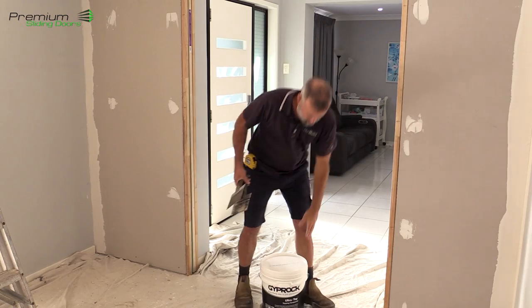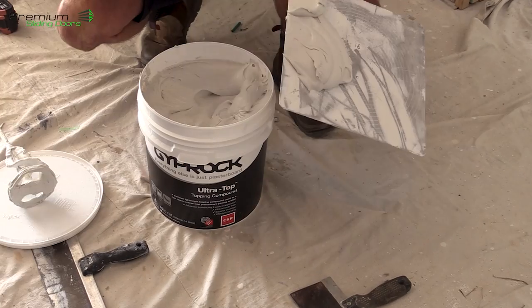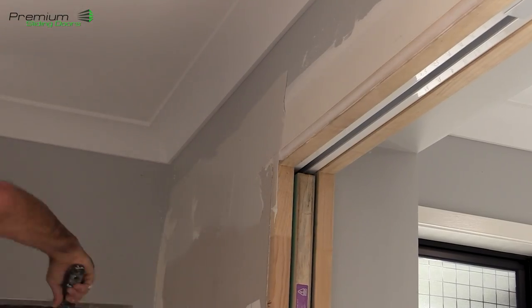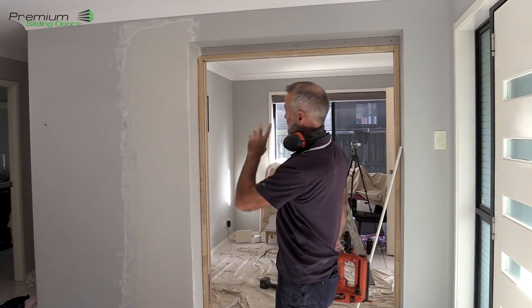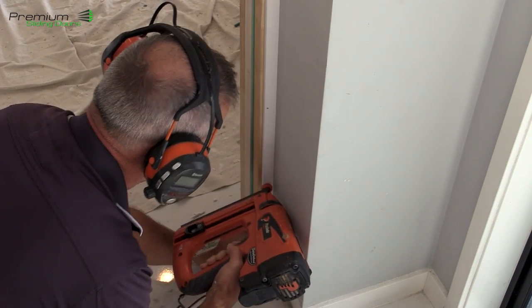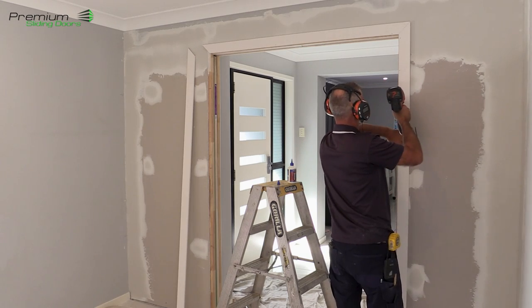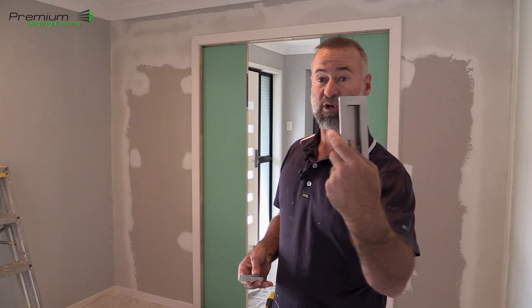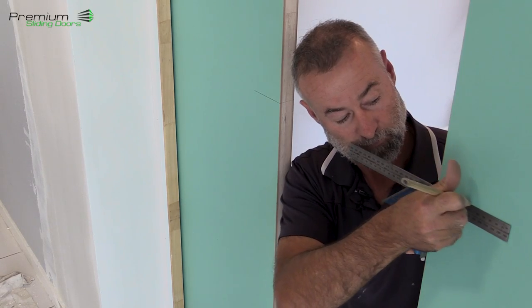I've done my base coat and that's set to reinforce all the joints on the plasterboard. Next up I'm going to use a finish coat — a topping coat over it. Now that that's set I'm going to start on the architraves and skirting. I've got some 25 mil nails — my architrave and skirting is only 11 mil thick so they'll bite in about 15 mil. Next up, the handles and flush pulls — I'm going to situate those halfway up on each door, mark that out, and get them installed.